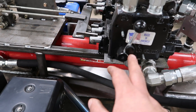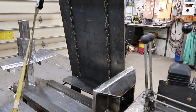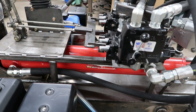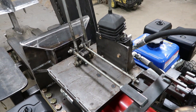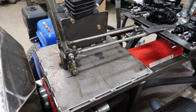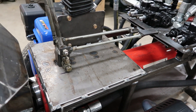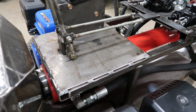The flow control has a 1-to-10 setting. This valve is rated for 30 gpm and I have it set at about 1-2. If I move it up to 10 I can flip the log lift right over, and the wedge is just crazy fast. I can adjust it around, but it works really well where it is. By having this I'm not lugging the motors down or trying to divert the full pump flow through a valve body that's only rated for 10 or 15 gpm. One thing I need to redo is the linkage — the pivot points were something I built around 12:45 at night. It works but it's going to get redone.